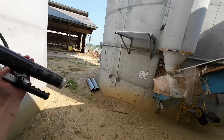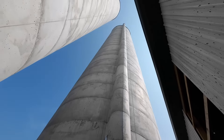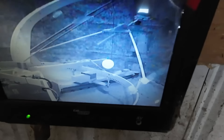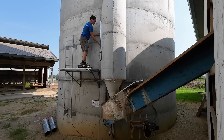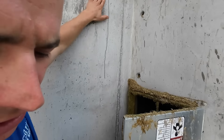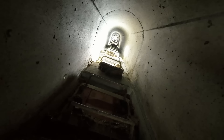Hey guys, so it's the next day now and I'm going to go up in this silo. We'll move the unloader down a door and I'll take the grease gun along. I don't need to grease it that often but it's due for greasing now. So we have this camera up in our silo — you can tell when there's enough space to drop the unloader down a door. We don't have to switch the door that often — it's about every two weeks or so now. It's going to be less and less often as we get lower in the silo where it's more packed. Most of the rungs aren't too bad but you do get a few rough ones. We'll climb up to the feed level — it's about halfway up.